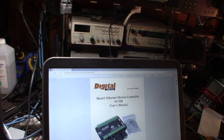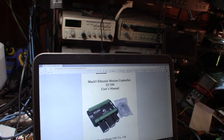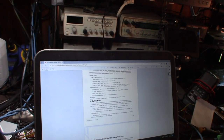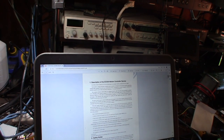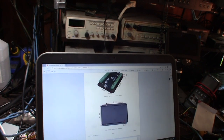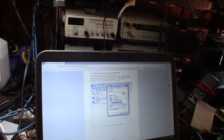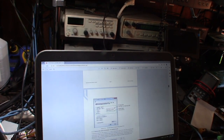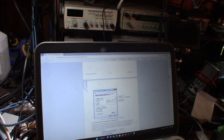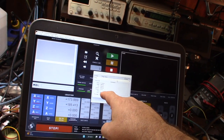The IP range is 192.168.4.x, which is actually helpful because most home routers default to 192.168.1.x, which could overlap. They should use an IP range that doesn't overlap with typical home router defaults. I'll set it to 4.10 and try again. I'm getting the 6X confirmation, so that's correct.